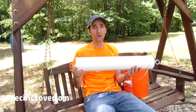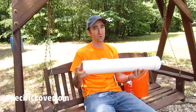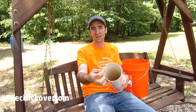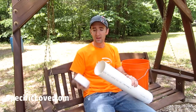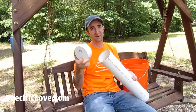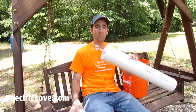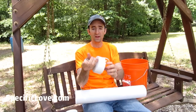This is a piece of four inch drainage pipe. It is PVC but it's not your standard schedule 40 — you have to go to another section. It is drainage pipe, and as you see it is much thinner than your standard pipe. You'll also want to look for the caps that are only for the drainage pipe. They're much thinner, a little bit different shape, and a lot cheaper than your standard PVC caps. You want one to go on each end, but before you put all the caps on, we're going to do one more thing.